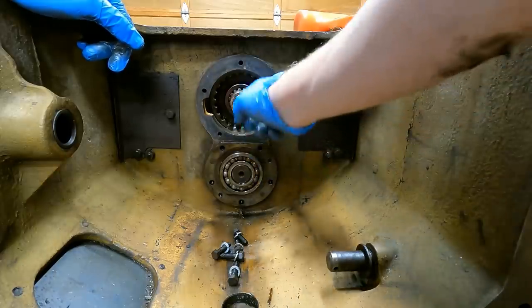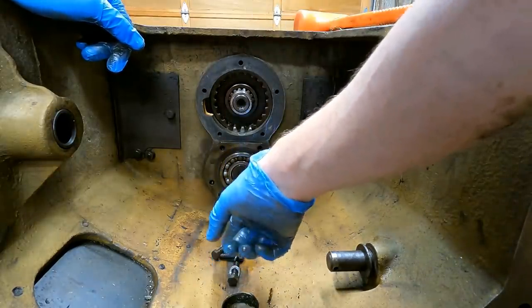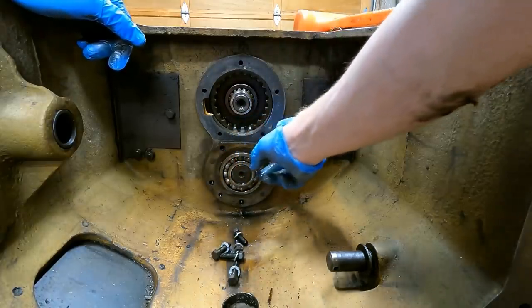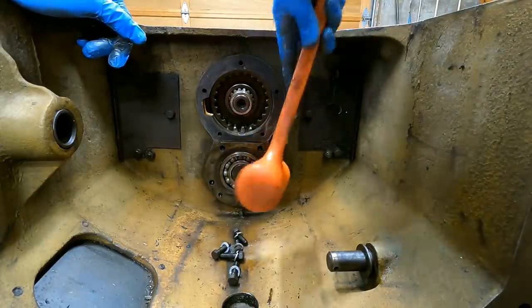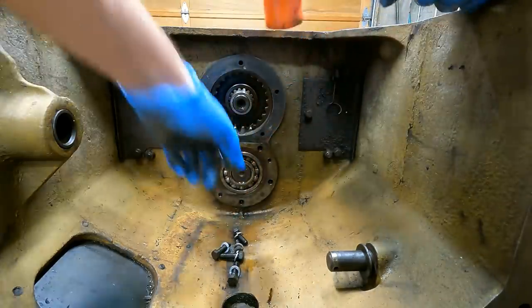You know, I made the same mistake on the top shaft, now that I remember it. There's another cover that goes over it, and then these bolts go on. So I was trying to put these bolts on first. At least that got this plate set back all the way, though. So I still need to get the shaft pushed forward. What's happening right now is the shaft's bound up on this bearing. It's not wanting to go all the way through.